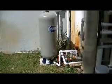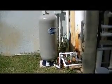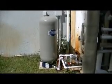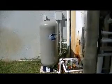In the middle, towards the bottom, that small cylinder is a sediment trap to catch any sand or other debris that might be in the well. And everything basically plumbs from there into the rest of the plumbing system and up to the heat pumps. And from there, of course, the heat pumps have refrigerant connected to an air handler.